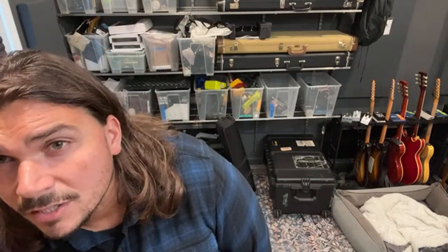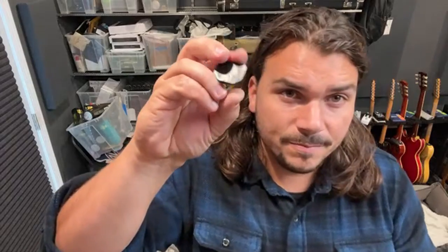I was wondering if I still have some here that I could show you. I'm just looking at all my kind of materials here, if I can easily identify. Oh, I have one. Here it is. IEC plugs. So they look like this, and you can see it kind of matches what the back of the power supply would look like. So on the second power supply that's being fed, that you're paralleling to, you just put that in the back to make sure that nobody accidentally touches that. Otherwise, they get 120.